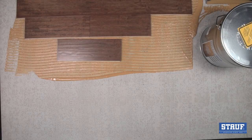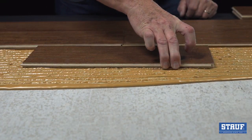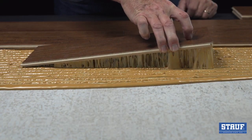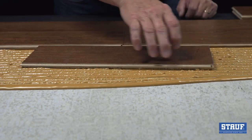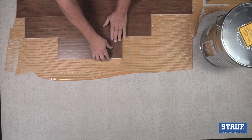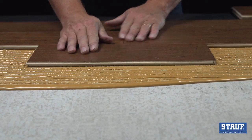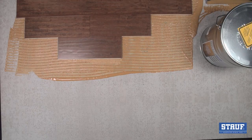When the flooring is left alone for just four to five minutes, the transfer has occurred between the adhesive and the board. While still dry to the touch, and even though the board was not pressed down, the legs have formed between the board and the subfloor, eliminating hollow spots. Also notice there is no memory in the adhesive, which some competitive products have. No memory equals tight sides and end joints during installation.